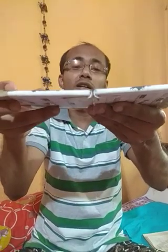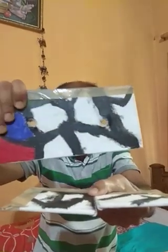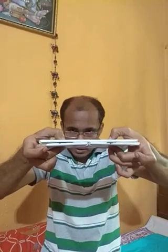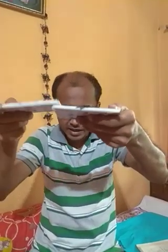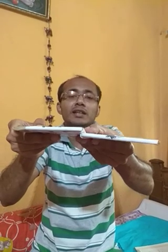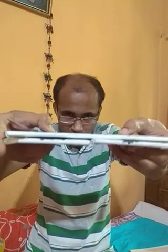And in the other case, a plate is placed between, and this plate is also drilled. You put the joint like this, and these two holes will be matched, and if I join them by rivet, then it will be called butt joint. So again, if we join the plates by overlapping, this is called lap joint, and if the joint is kept in this manner and another plate is placed over it and joined like this, this will be called butt joint.